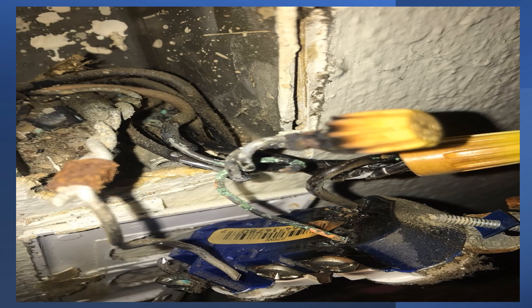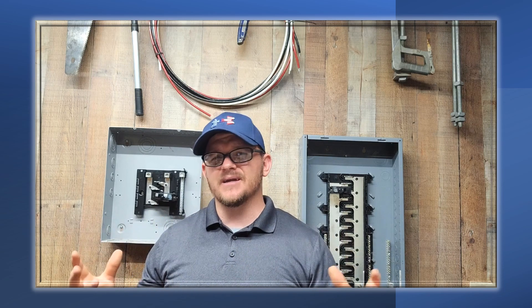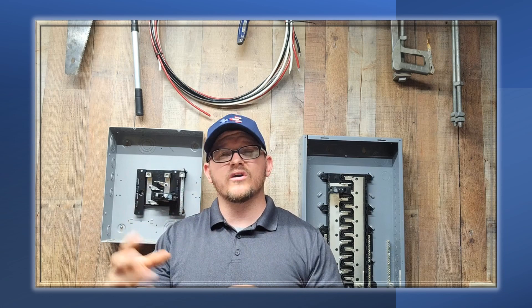Tomorrow I'm really excited about the video — we're going to talk about the fixes. I never tell somebody we have to rewire the whole house unless it's really bad or really old. Even then, sometimes you'd be surprised — some houses from the forties and fifties, you get in there, make fresh connections on the lights, switches, and receptacles, put a new panel, and you might get another 30 to 40 years out of that house. Just because you have aluminum branch circuit wiring does not mean you absolutely have to rewire your home. You need to have a certified and licensed electrician come out and take a look. Tomorrow we'll talk about the correct way to do it that will give you a rock solid connection for years to come.